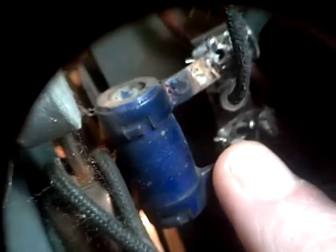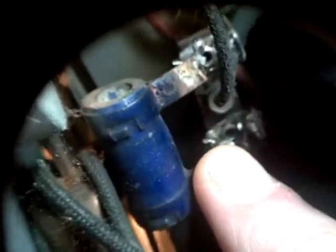One wire comes out of here. The other wire continues on up through this joint and into the schmozzle up here. This resistor, which I measured at 200 ohms, looks to me like the replacement for the shadow meter. If I take this off, put the shadow meter connection here, I mean that all makes a fair bit of sense, except for this cut wire here. Not sure why somebody would cut this wire.